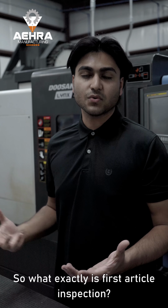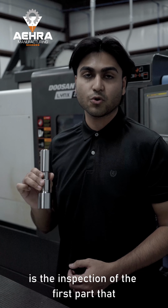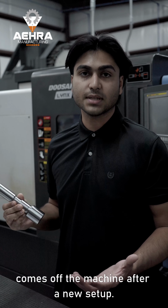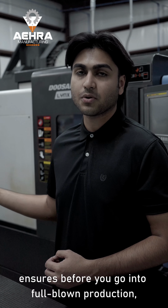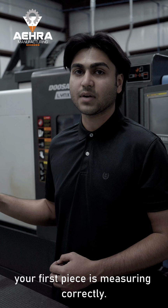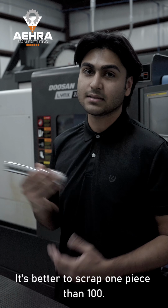So what exactly is first article inspection? First article inspection is the inspection of the first part that comes off the machine after a new setup. This is the most crucial inspection as it ensures that before you go into full-blown production, your first piece is measuring correctly. And if not, adjustments can be made. It's better to scrap one piece than 100.